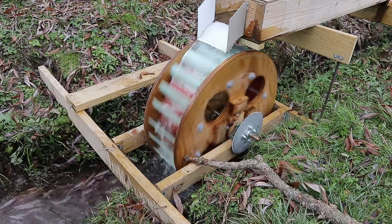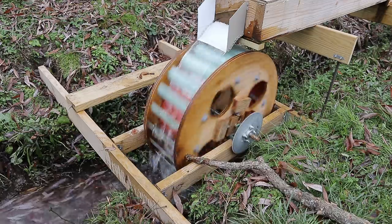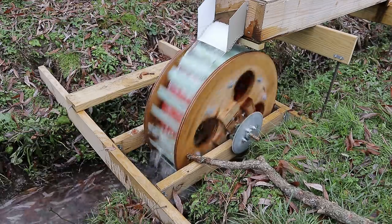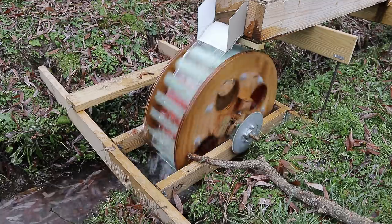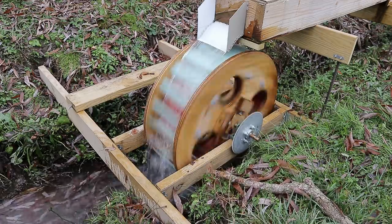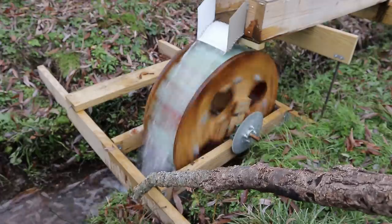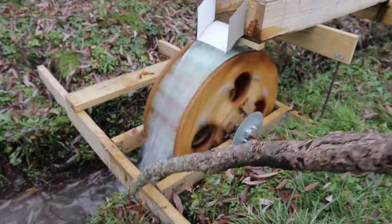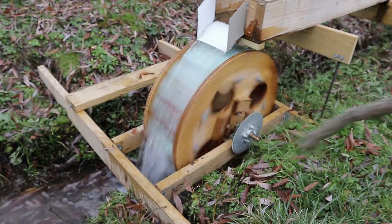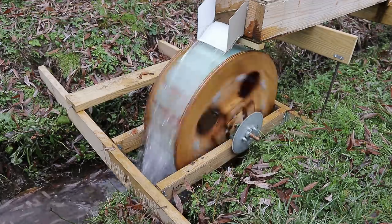So it's acting more like a reaction turbine instead of like a water wheel. Whereas a turbine relies on high velocity and then reversing the flow, which is sort of what it's doing right now. A water wheel is supposed to catch it at the top and then slowly lower it down. And it won't work as a reaction turbine unless the water is shooting at it all the way down here at the bottom. Because right now where it is, the water's coming off the wheel right here and it's losing about a foot's worth of power. It just converted into heat and noise and turbulence.